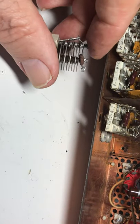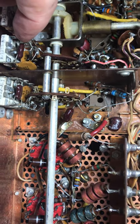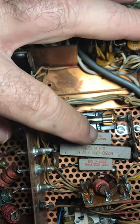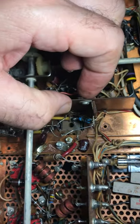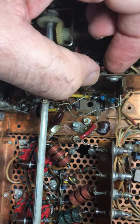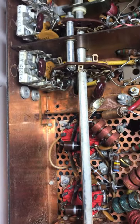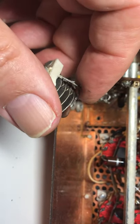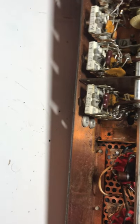I guess the radio will be fixed, thank god, if I didn't blow out anything else. I noticed my two LED lights burned out — I must have surged them with 600 volts somehow — and the fuse burned out too. I don't have a spare fuse so I put a tiny strand of wire on there just to test the radio again. What happened when I first tested this transmitter last week was the 600 volts back-flushed into my AC4 power supply and wiped out the diodes, so I had to rebuild the power supply.